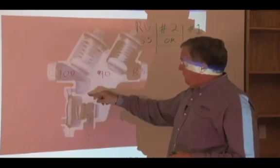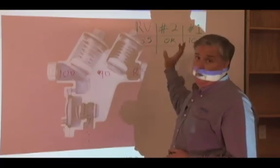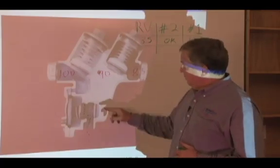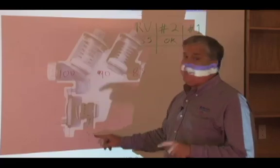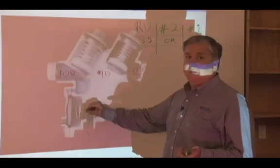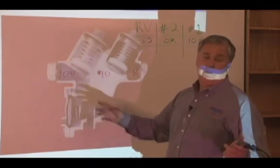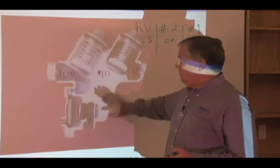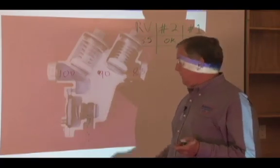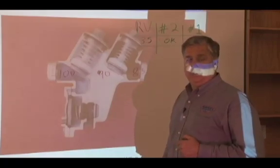And that nuisance drip could come from any mechanical seal along that portion of the relief valve, as long as we know hydraulically that assembly is working properly. So look for the usual, and the amount of leakage is directly proportional to the leak. In other words, if it's a little drip, drip, drip, it's a little nick. If it's a big gush of water, an O-ring's missing or something dramatic is taking place. So nuisance drips are something we have to deal with on all RPs, and this is just a good picture to show it to you where you can see it on the Conbraco 40-200 series.